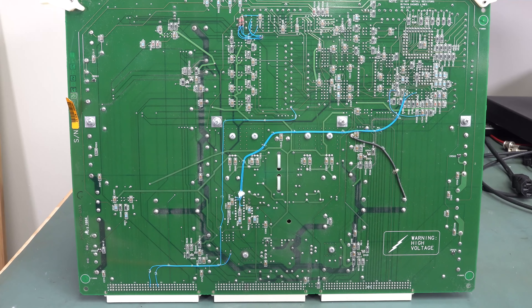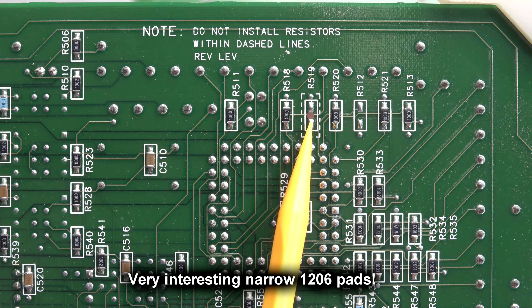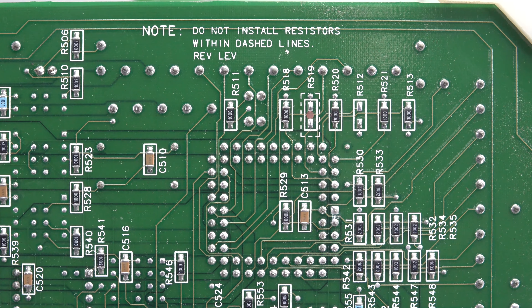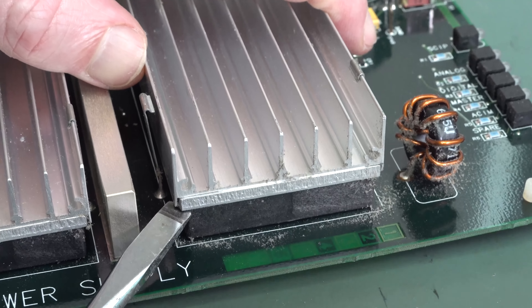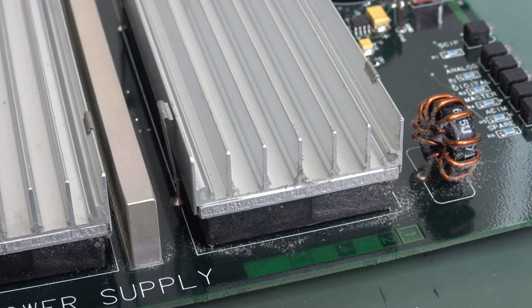The board says 'Do not install resistors within dashed lines' — and sure enough there's one with a dashed line and no resistor. That little dot in the middle is a dollop of glue under every SMT component on the bottom of the board — 1206s by the way, none of that 0402 rubbish. It holds the components down for double-sided loads so they don't fall off when you reflow the other side. Sometimes gravity's a bitch. There are thermal adhesive modules here that just won't come off. This is the digital supply board — you might think it generates different rails, but it only does five volts.